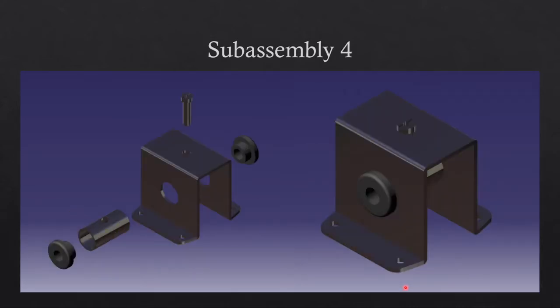The final sub-assembly is the bearing sub-assembly, which contains a couple of rubber plug parts on either side. The bearing itself acts as a stabilizer, holding the crankshaft in place so the valve can rotate along with the crankshaft within the constraint of the bearing holder. These are all simple designs — the parts didn't take very long to make, assemble, or constrain.